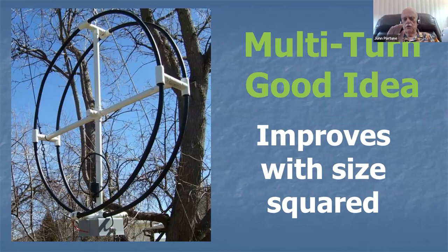If you look at the formulas for the efficiency of a magnetic loop, they show you this: the efficiency of a magnetic loop goes up as the square of the number of turns. So if you double the number of turns in a magnetic loop, like this magnetic loop you see here, the efficiency of it, in other words, the amount of power you lose from your transmitter in the conductor loss, that number one factor I pointed out to you, the amount of power you lose in the conductor loss compared to the radiation loss, goes up as the square of the number of turns. So increasing the number of turns in a magnetic loop is a definite advantage. So if you do any design of magnetic loops, think about a multi-turn magnetic loop. If you're not into design, make them in the normal way. But that's a bit for those of you who may be into design.